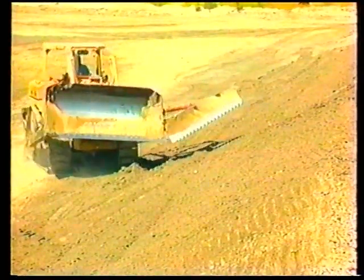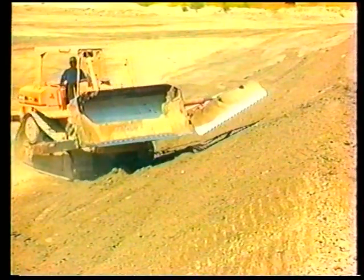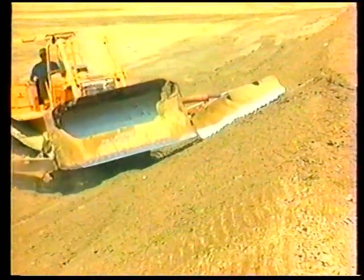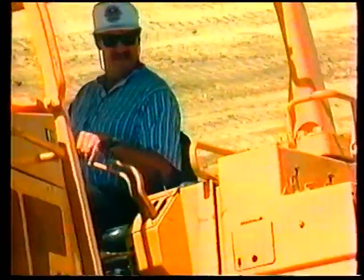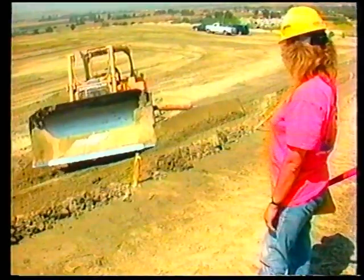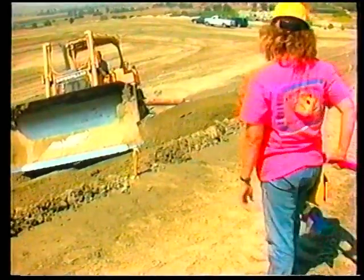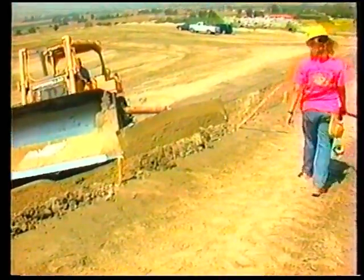To trim a high slope that has minimum excess material, use the slope board control and tilt the slope board down level with the dozer blade. Then at the far left of the slope, climb the dozer up the slope. The top left-hand side of the slope may have to be back-dragged to get started. A grade checker is recommended any time a slope is started. This will help reduce the chance of undercutting the slope.